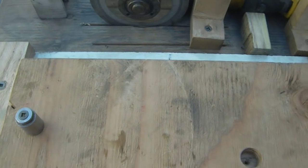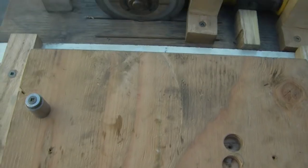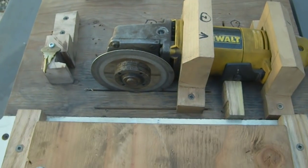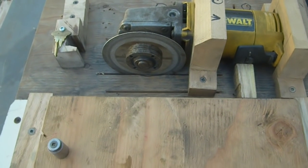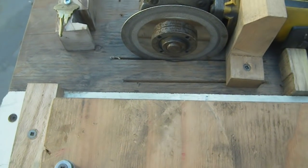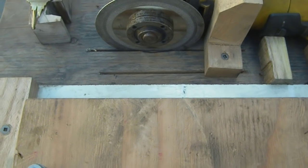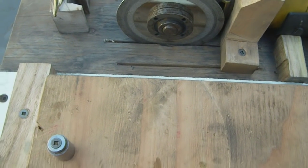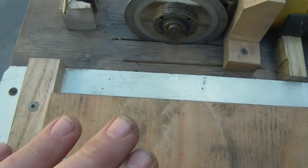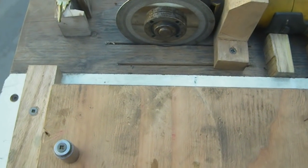The main part of this whole jig is that you've got some movement, and it's really easy to come up with. The key here is that the whole thing is quite low. The sharpening jigs I've seen for sale are elevated — as soon as you elevate things, you introduce flex and movement, and that's not good.